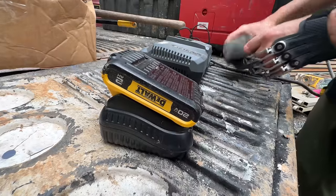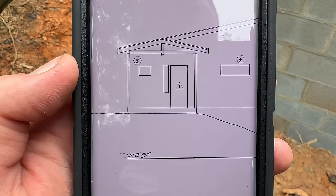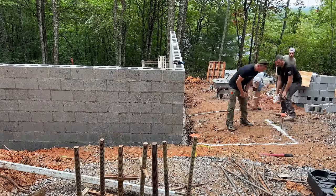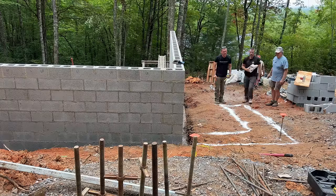It's Monday morning, we're back on site. I see an excavator, which is awesome because we need to build a front porch. The reason we haven't done it yet is because we didn't know what we were doing until right now. It's drawn on the plan as a nice little porch just on grade, but you can see right here there is no on-grade — it's like a six-foot drop. So we're going to build basically an L-shape to retain the backfill that's going to be the driveway, leaving a place to frame a deck sunken into that.